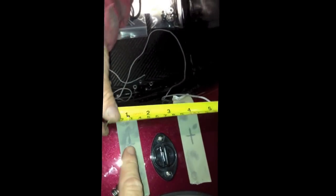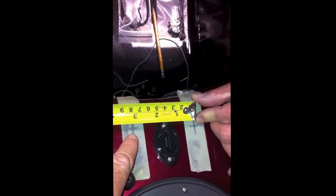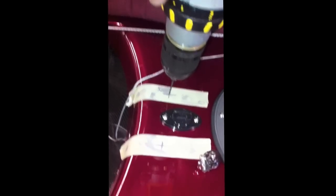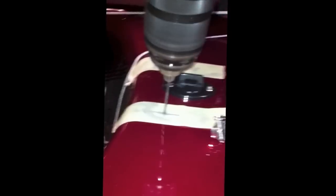Now what we're doing is locating the blocks. As you can tell, we're about three inches between. Now what we're doing is measuring the distance between the center of the blocks — it's about three inches there. And you can see how that's sitting away from the rudder post there. So here comes the fun part: drilling holes in the hull. This is where the blocks will go.